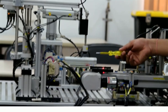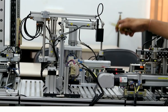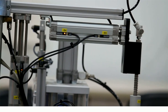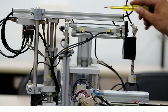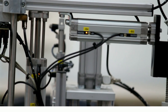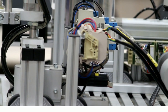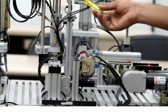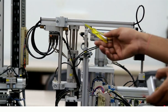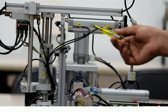Next, this is a vacuum generator — it picks any object using vacuum. Pneumatic air comes from this port and generates vacuum. This is a pneumatic cylinder, and both sensors here are magnet-type sensors that sense the extend and retract conditions of the cylinder. Right now the cylinder is in retract condition, so you can see the sensor is on and getting the signal. We have a stepper motor for exact positioning of this handling unit for the pressing chamber. These are solenoid valves — a solenoid valve is a type of output; when the valve opens, pneumatic air passes through the cylinder and the cylinder moves forward or retracts.